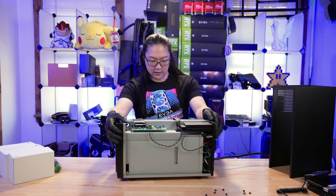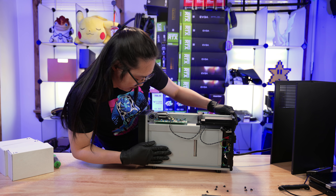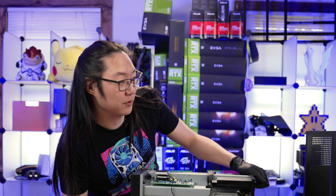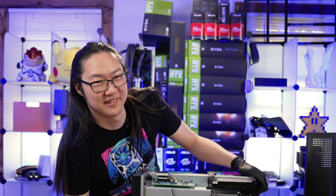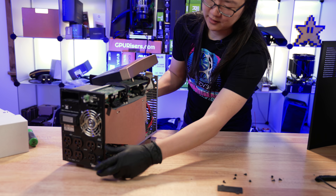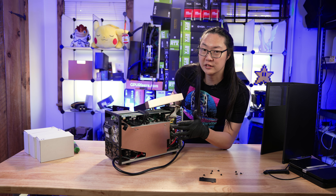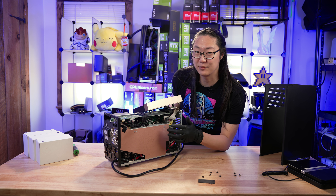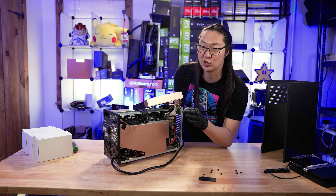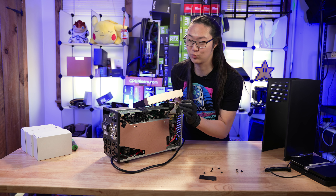So let's take a look at how the batteries come out. It looks like they're in this compartment right here. I just realized something — I don't think you have to take that cover off. On these type of UPSs, there's actually this piece of paper right here. You really, really do not want to touch anything behind that piece of paper, because there are capacitors that hold a ton of energy. Remember, this is a double conversion — there's a whole bunch of electronics in here. That's why it's so huge.